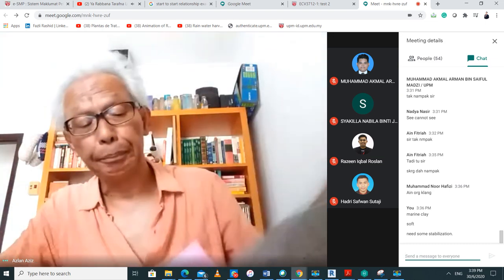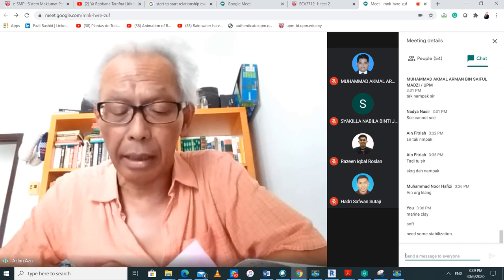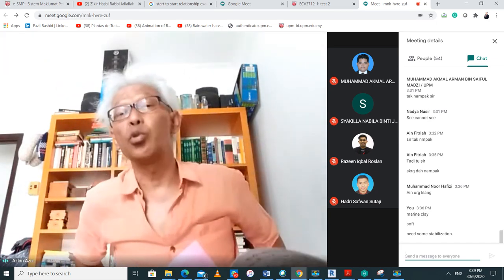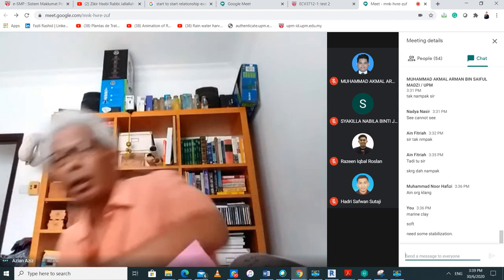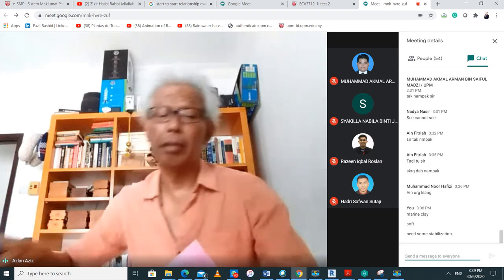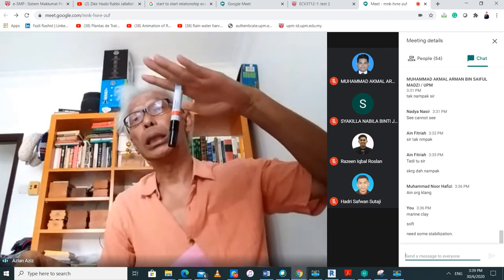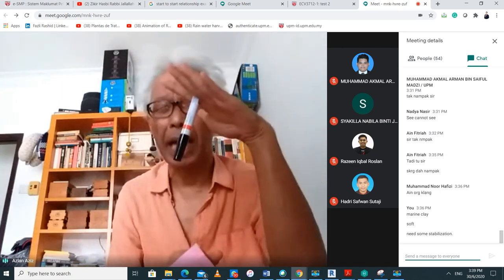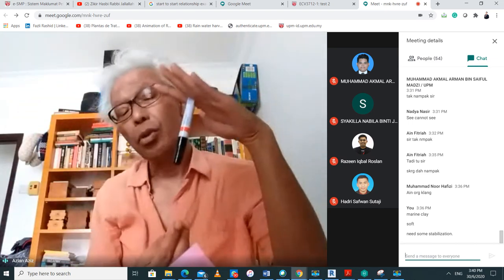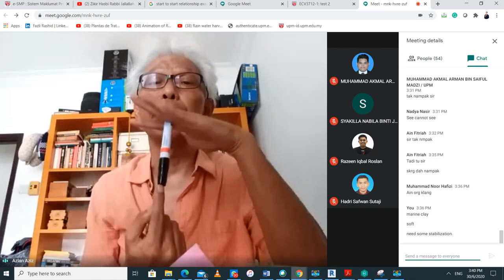Now, moving on. Types of pile, general classification is into two types. One is the end or tip bearing pile, the other is friction pile. This is the general classification that they say to you in industry. This is the simple idea of a pile. So I have one pile here with me right now, okay? And if I'm going to put it in the ground, that's my pile. So the soil is around the pile. If I put a load on top of my pile that comes from the column, my soil is going to resist that load. So it's going to resist at the tip here.